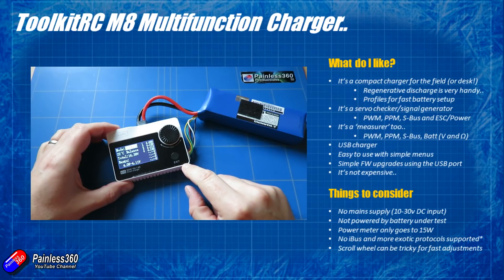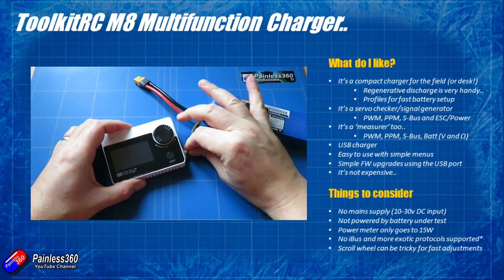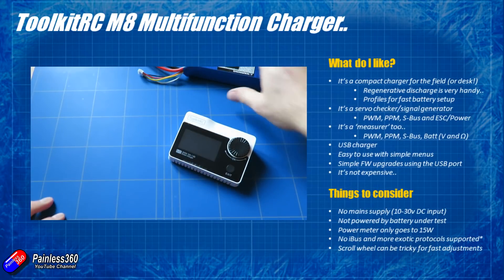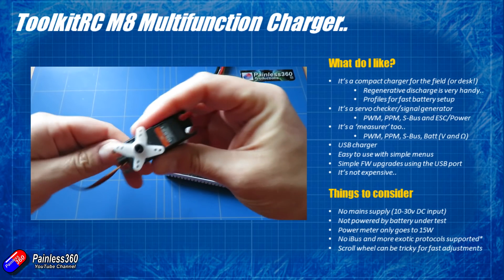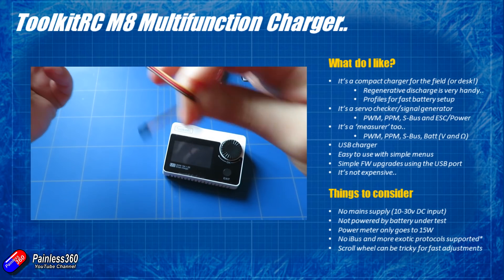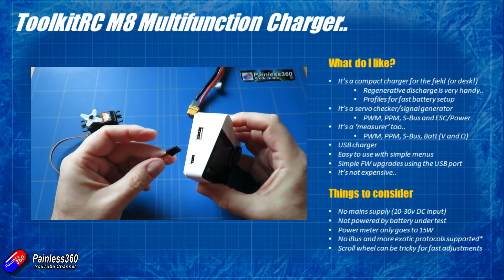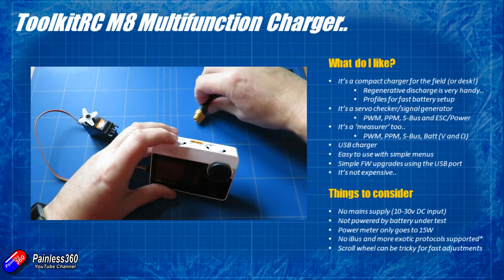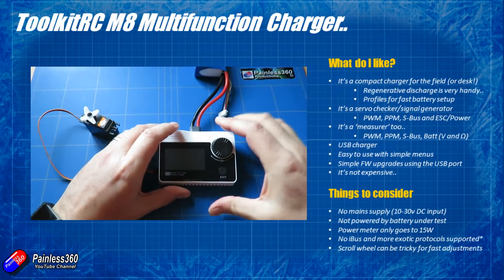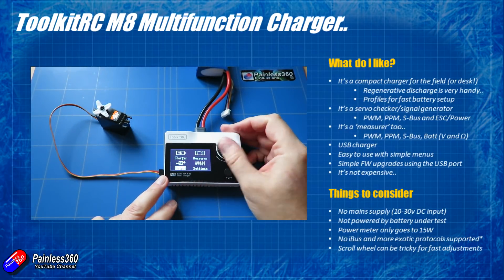You can also use it as a power meter, but it only goes up to 15 watts, so you can measure the power being output and control the throttle signal going out of it — a cute little idea. Unfortunately at only 15 watts it's not really useful for testing any decent-sized ESC, motor, and prop setups that most of us are going to encounter. Also, at the moment there's no support for protocols like IBUS, Fport, or CRSF, though hopefully that will come in future firmware updates if enough people ask for it.